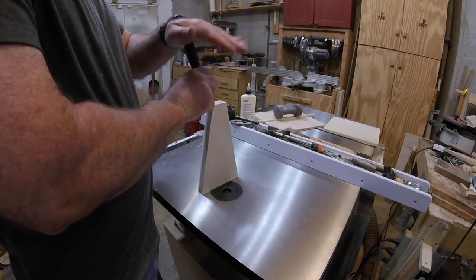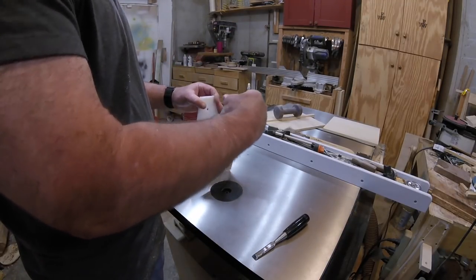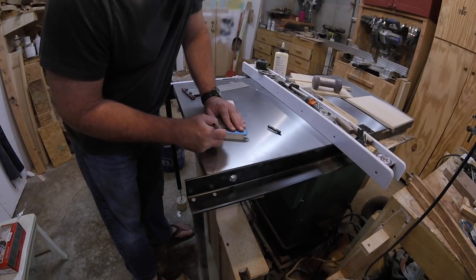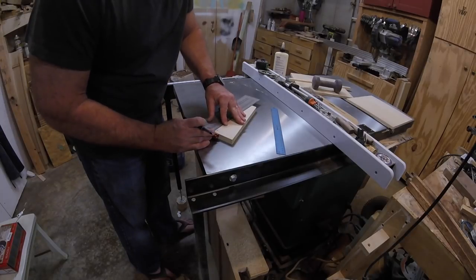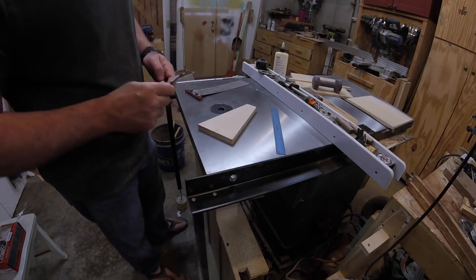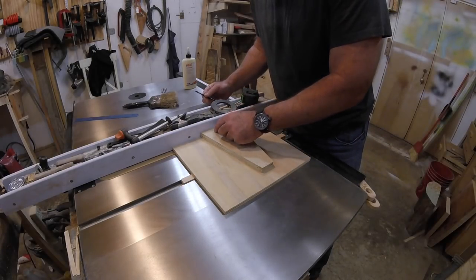Although pretty compact, I've made the sled big enough so that the placement of the wedges is not critical, other than being square to the blade. So I'll roughly figure out where the center is, then draw a perpendicular line so I can drill some holes to mount the wedge to the sled.